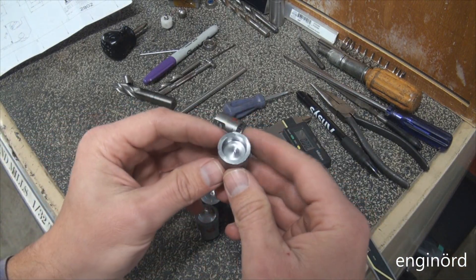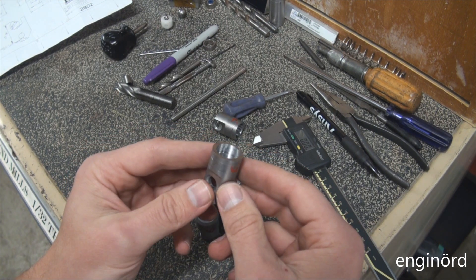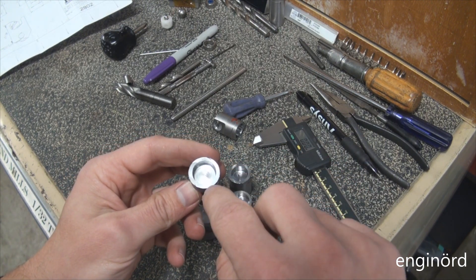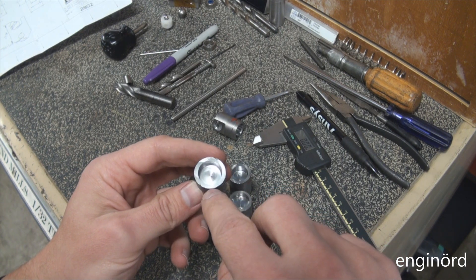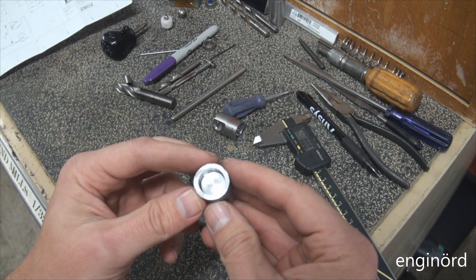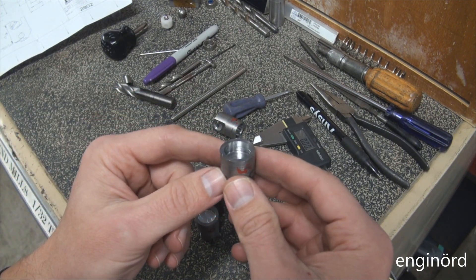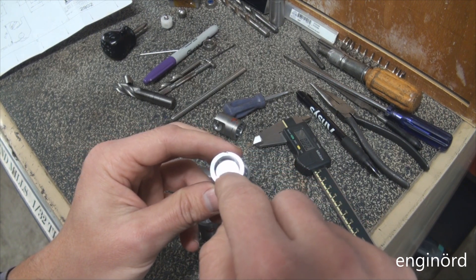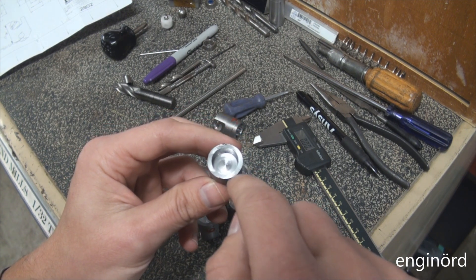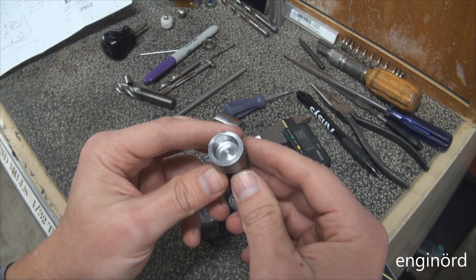These are kind of hard to chuck and remove from the collet chuck. So what I'm going to do next is change the tools. The next operation is going to be cutting a chamfer, getting rid of some of these tiny burrs with a countersink - essentially milling a chamfer with a 90 degree countersink. The next one is milling the socket with a 6 millimeter ball end mill. And then the last operation is drilling a hole with a 2 millimeter drill - that is going to be interesting.